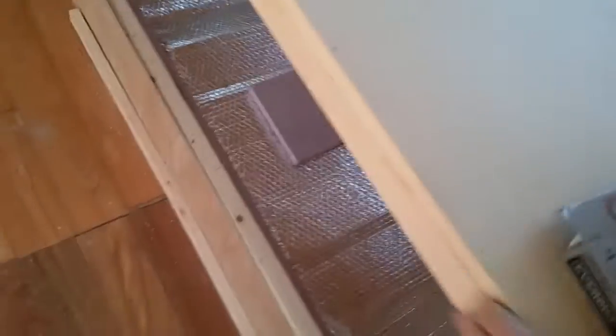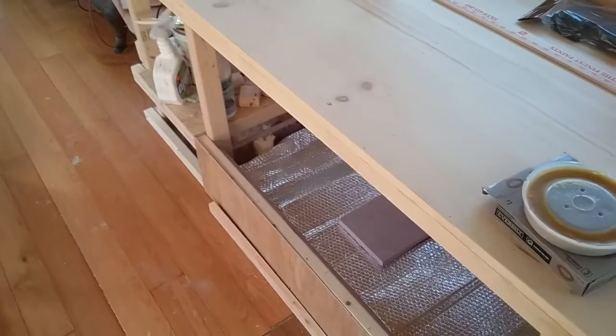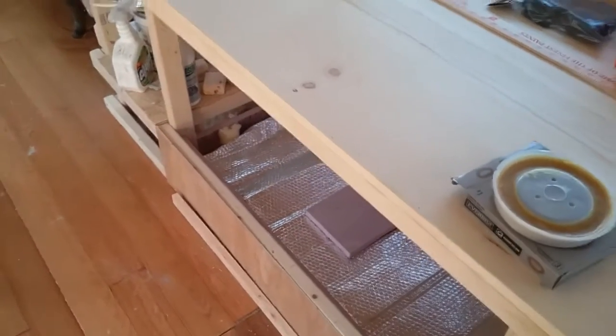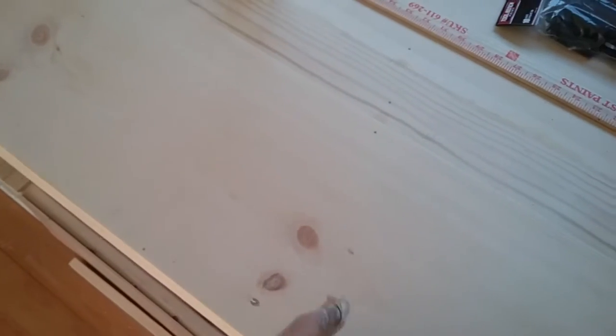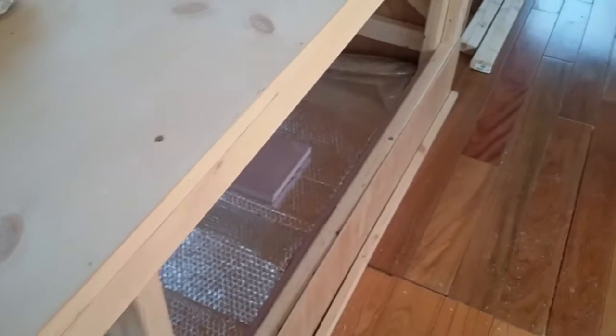So I'm sitting on this table that I started building. There was a guy who had tables for sale — he wanted a couple hundred dollars for the wood tables. The way I think of things is, I don't mind buying quality products for inside the bus, but if it's something I can build and it's going to come out just as nice with my own artistic twist, I'm just going to do it myself. This is not the best wood — it's not hardwood — but it's coming out awesome. I joined everything, wood glued it, clamped it all, let it sit overnight, then sanded everything down and put the edges on. So there's another piece of wood joined all the way around, so it looks like a thicker piece than it actually is. Once it's all stained, I think it's going to look awesome. I'll polyurethane it.